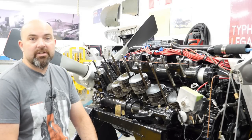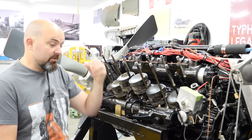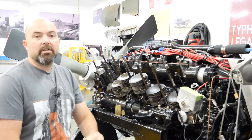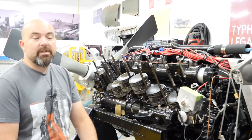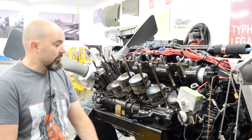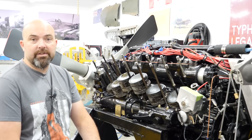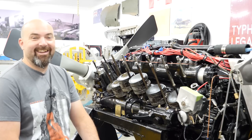We cracked a fitting on the other side of the engine, just above the entrance where our priming pump goes into, and water came out of it. What had been happening was over time, since we filled the cooling system, the cooling system had drained down into the oil system. That fitting released 99% water in the oil system. Neither Rob nor I were impressed with it.